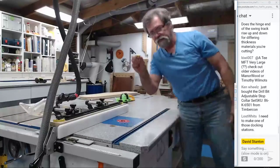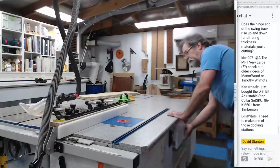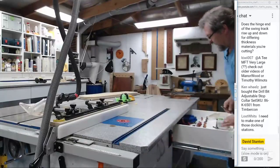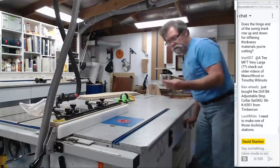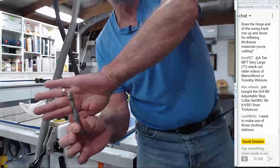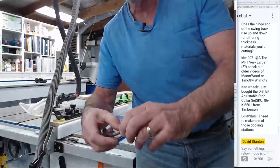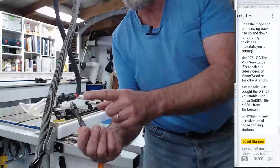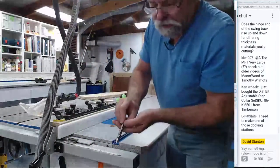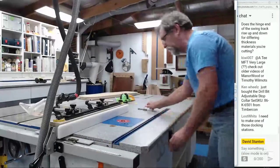So this thing here, if that's not in, I can't turn that on. I'm going to replace that cutter in there with a flush trim spiral up cutter. That's this guy here. All right, so this has got a double bearing at the top for those that are concerned about bearing snapping, and a spiral up, which means it's going to pull the dust towards the machine. If it's that way up, it's going to pull the dust this way. If it's this way, it's going to pull it down. So in the router table, it will be pulling it down.